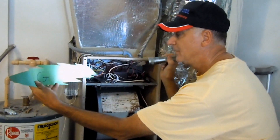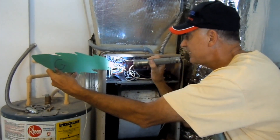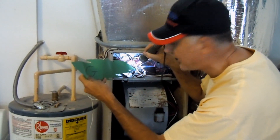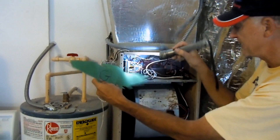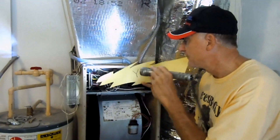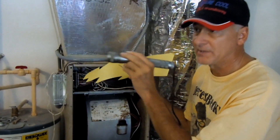In a call for fan, you get a G signal from the thermostat and that will energize the fan relay — it's back there, so it's kind of hard to see. In the cooling mode, you get a Y signal. And at the same time, since it's a heat pump with a reversing valve that is cooling active, you get an O signal. You do get a Y signal coming into the air handler before it goes out to the condensing unit.